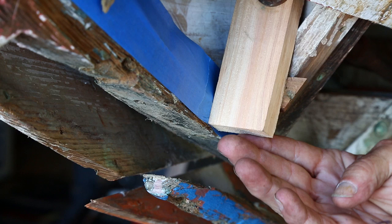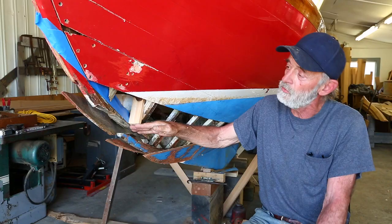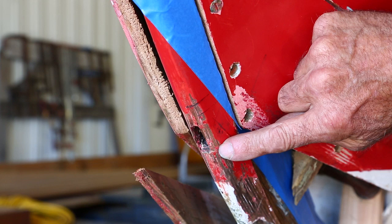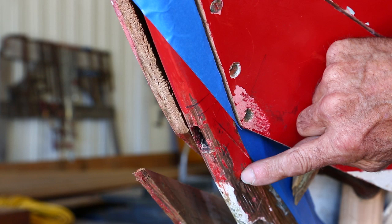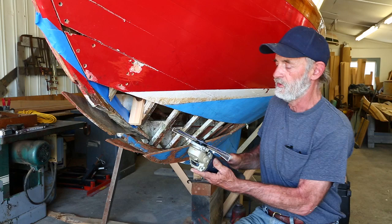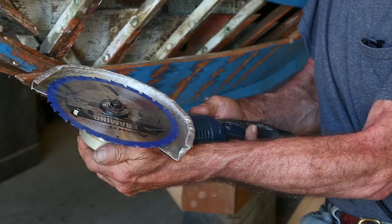I've also got a little piece of wood clamped on here as a visual aid to help me keep my blade nice and level. I've also moved that line up because up forward I knocked the floor timber bolt out, and that same hole for the floor timber bolt I'm actually going to use as the very forward bolt that holds this piece I'm going to make into position. I'm going to take advantage of that hole and make the incision with this tool right here.